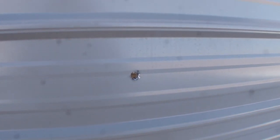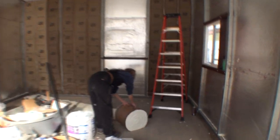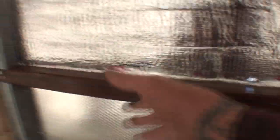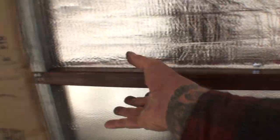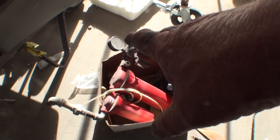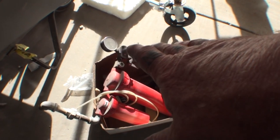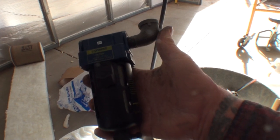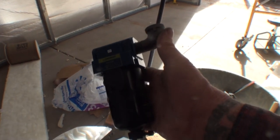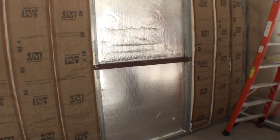There'll be an air nipple on the wall right here where I'll be able to hook up air, and then it will come into the building right here where I put this piece of two-and-a-half-inch tubing. I'll mount everything onto this, which will include my spray gun water and oil separator. And to be on the safe side, we're going to add this extra filter — this water separator filter right here. So we're going to have two filter systems on the wall right in that area.